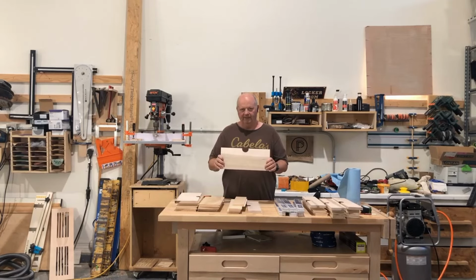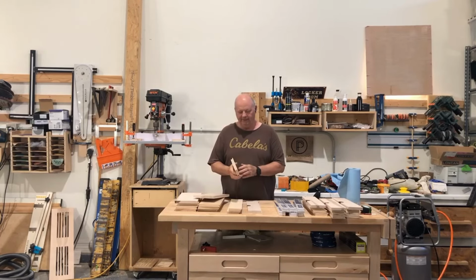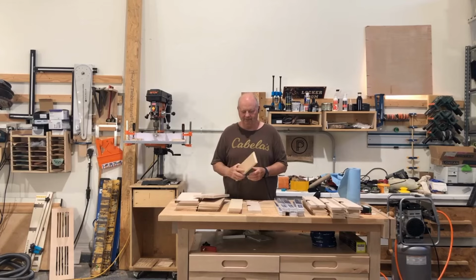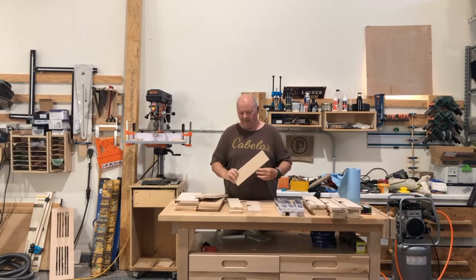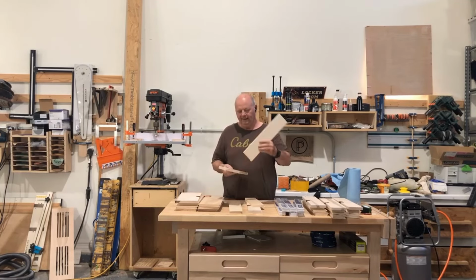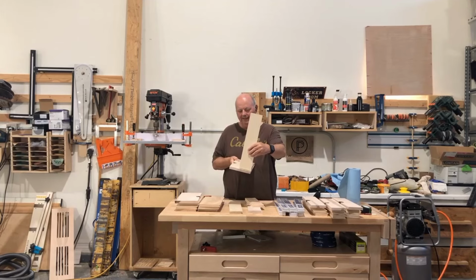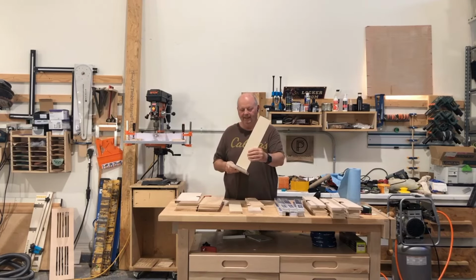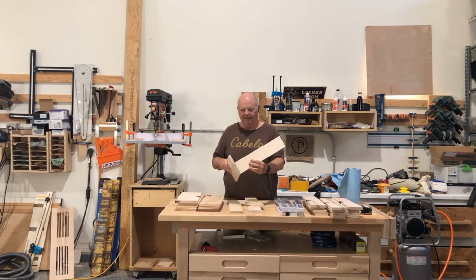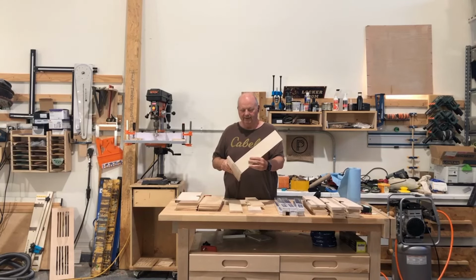As mentioned before, the fronts I made with soft maple, and the sides 3/4 inch, and the rest of the box 3/4 inch plywood. I'm going to do something different than I've ever done before. For the back, I will put pocket screws to put them together. And then the front, I will do pocket screws again, but doing it this way. Again, it's not the way I usually do. Usually I'll do a box, and this won't be as strong, but again, being small drawers, I think it will be plenty. This way I'm also going to be hiding the drawer slides just so dirt doesn't get into it.